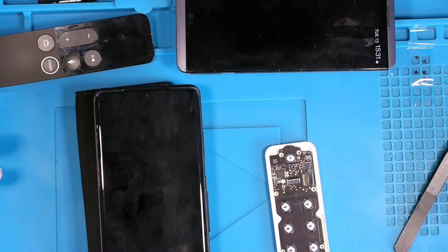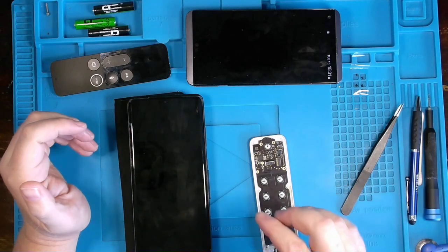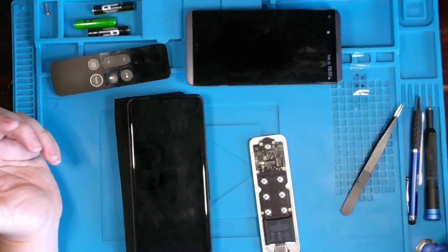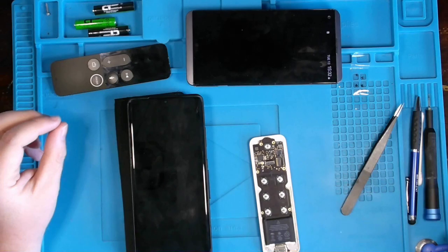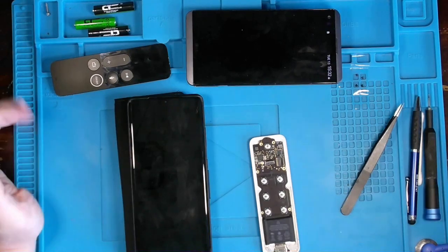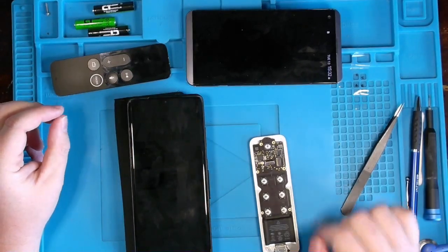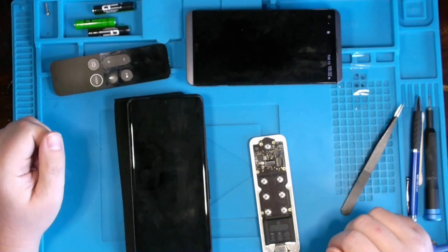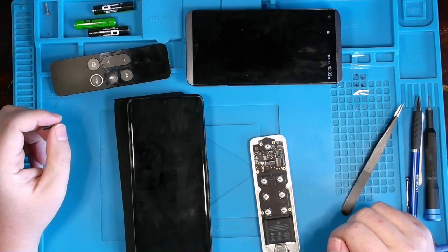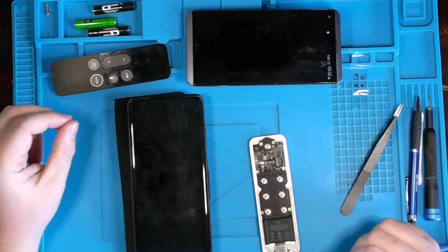Okay, so while I was able to identify with other devices throughout my house that this is in fact the Bluetooth radio or transmission ID being sent out, and to various degrees able to connect, none of my devices could I control by this remote, and most likely simply because there's a compatibility issue. The Bluetooth is designed to work with an Apple TV product, and then the IR blaster is managed through the application of that product as well.